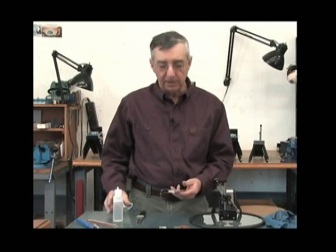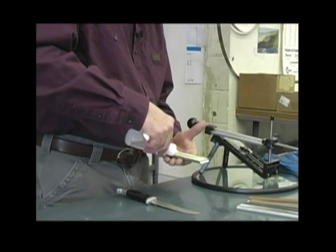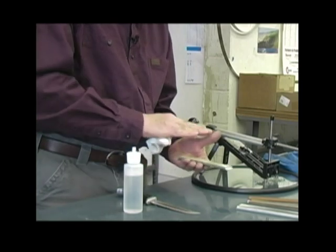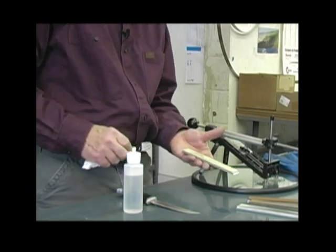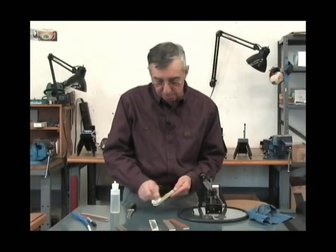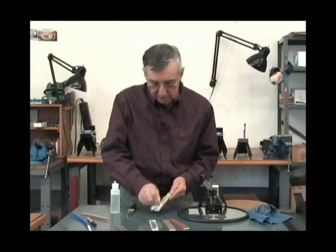And then when you're finishing the knife, if you put water on it, you will get a little bit higher finish, but just use a little tiny bit of water like that. If the water starts to run over the edge of the tape, it'll release the glue. So you can use water on them, but just be really delicate about it.